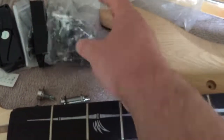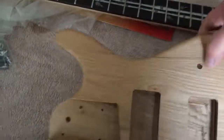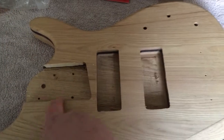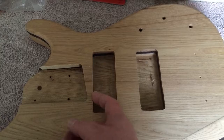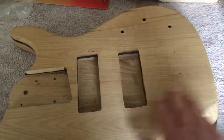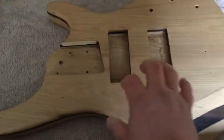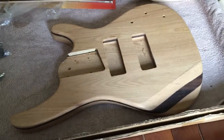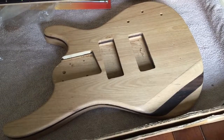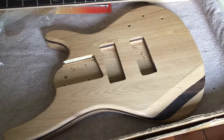So the first job I'm going to do — I've got this all prepped for staining. I'm going to rub down all over, make sure any defects are dealt with — including here where they've tight-fitted the neck and chipped the wood trying to pull it back out. I'm going to have to sand that down, check where the glue is, get it drilled out for the pickup wires. Next time we come back I should have it all done — sanded to 320, ready to be stained — and then a couple of sand-downs to 800, and then we'll oil it up.